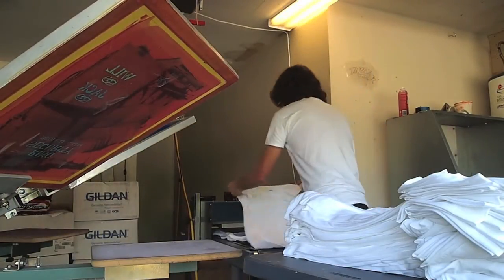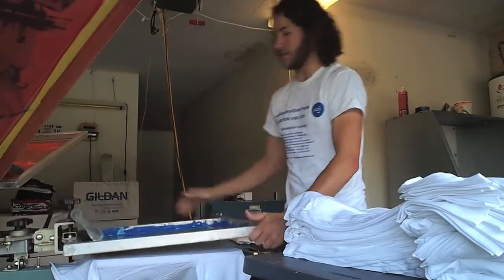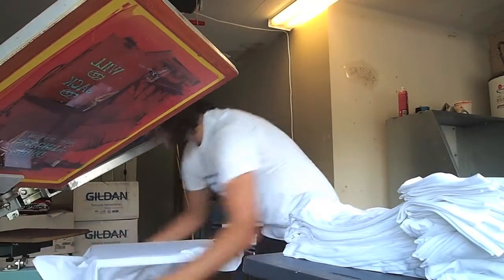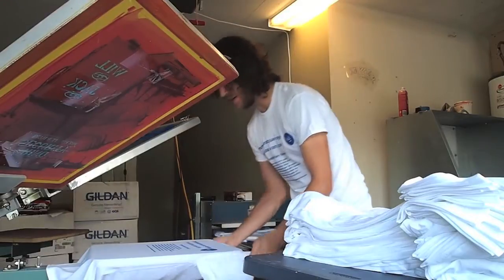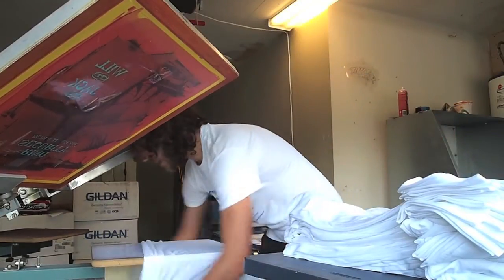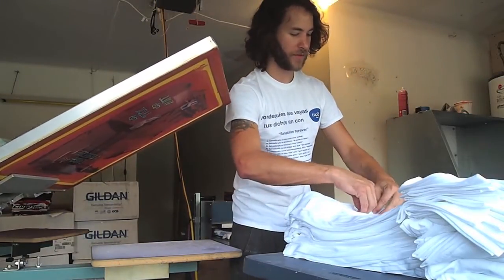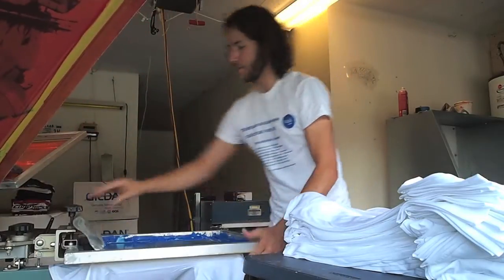When you're looking at equipment such as conveyor dryers, automatic presses, or tutorial videos, people talk about printing at 75 or 100 t-shirts an hour, and I never really knew how quick that is. So this was a way to figure out how quickly I'm printing. Right now I'm trying to print as fast as I can. This is just a simple one-color job on a white t-shirt with royal blue — this blue is really easy to print, so I thought this might be my best shot to see how quickly I can print.